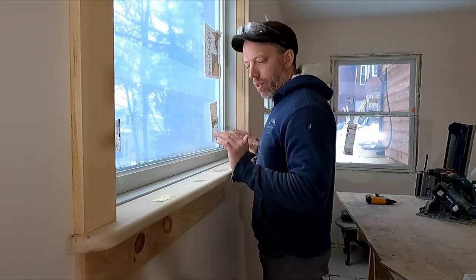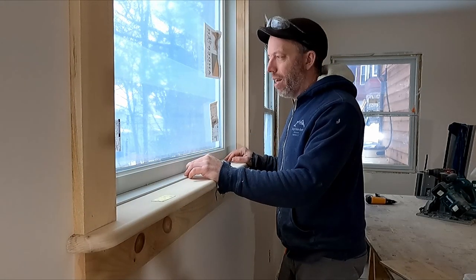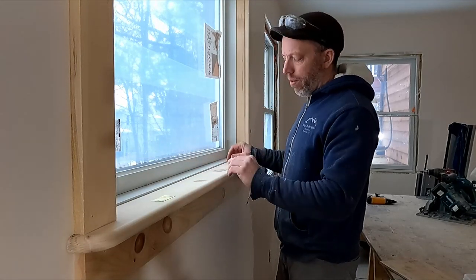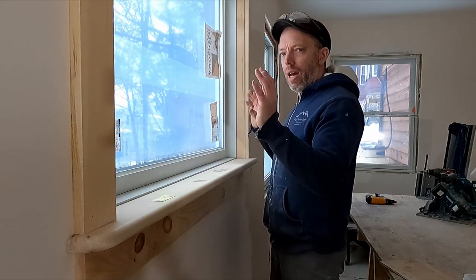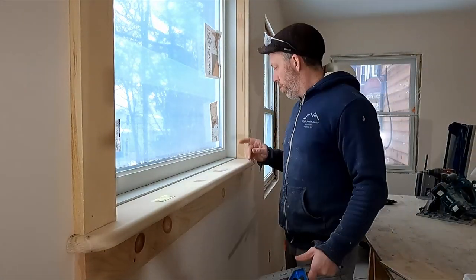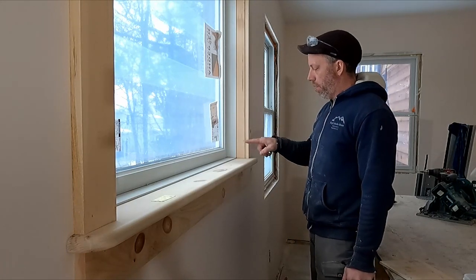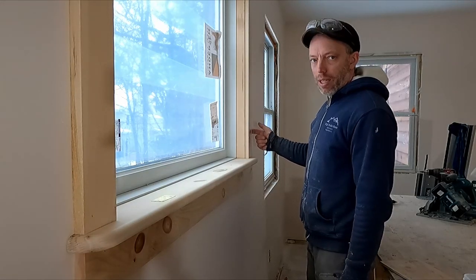First approaching trimming out a window, I don't know what the first really is. I do all kinds of things. I foam the windows in and clean that all out, and I scrape all the mud off. Once you get past all those things and you're getting ready to actually start trimming the window, the way I approach it is that I need to know the jamb extension, this piece here, between the edge of the finished window and the sheetrock. And you want it so it's nice and tight in here, and behind here, where you guys can see it here, right?